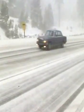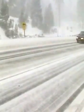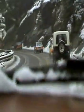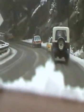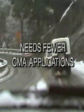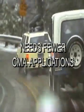After application of CMA, the snow becomes lighter and fluffier, taking on an oatmeal appearance. CMA-treated areas will not contribute to vehicle corrosion, and there is less danger of skidding. CMA sticks to the highway surface providing long-lasting anti-icing action. It is better than salt at preventing packing, and because it continues working for a longer period, it requires fewer applications — meaning the total amount of CMA used over the winter will be about the same as salt.